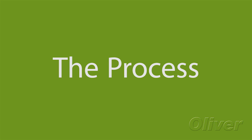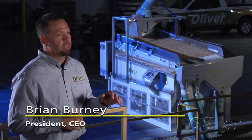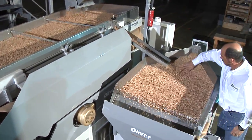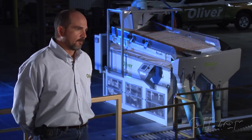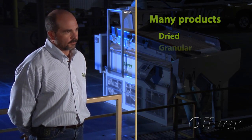When you bring material into a conditioning facility, there are multiple pieces of equipment in the processing line that help the gravity table do its job, which is to make a weight separation based on that particle's density. The physics involved in separation lend themselves to many different kinds of products — we can separate nearly anything that's dry, granular, and flowing.